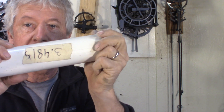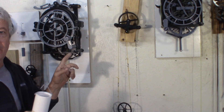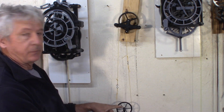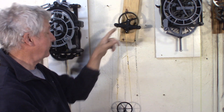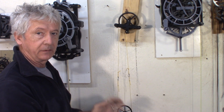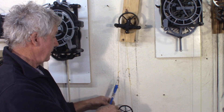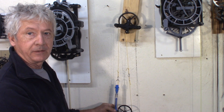I'm going to try with this weight — that's 3.5 kilos, actually the weight I'm using on the grasshopper clock. With the pulley at the bottom, it spreads the load and puts an even load on both gears and the teeth. By pulling on the string, I just see how much force I need to get the gears moving, and then with my scale I can compare the different gears.